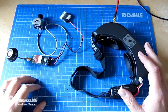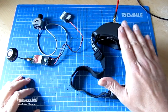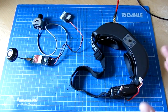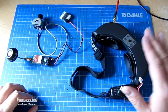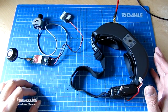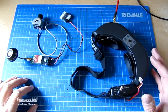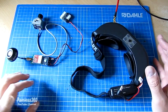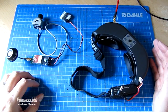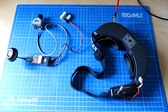The reason for that was, back when we were first getting into FPV as a hobby, there were two distinct options. There was a relatively expensive option that guaranteed all parts of the system worked together, or you could buy the discrete elements separately and try to get them to work together yourself. That included figuring out how you ran 5V and 12V cameras and transmitter systems together, whether the bands overlapped, whether the receiver could see the transmitter, and how the video signal was encoded. You didn't know if a BossCam transmitter would work with a Fat Shark receiver or vice versa. It became very complicated.